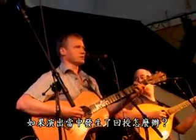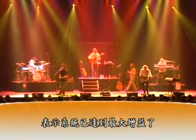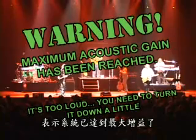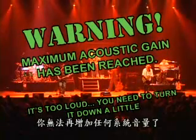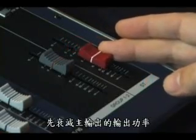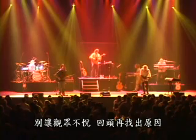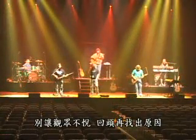If, during the performance, you experience the ringing mentioned before, you're being warned that you've reached a point called maximum acoustic gain, meaning that you cannot increase the volume any further in the system. You need to decrease the output level of the system until the ringing, which is obviously a big distraction to your audience, subsides, and then work on the problem later without the audience.